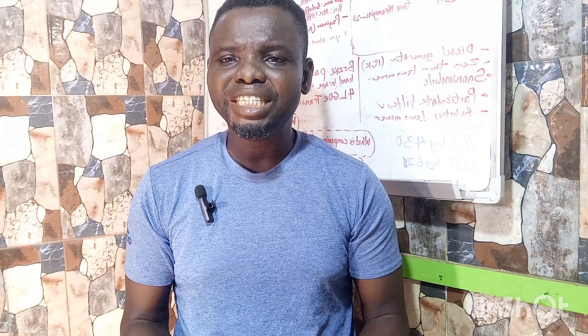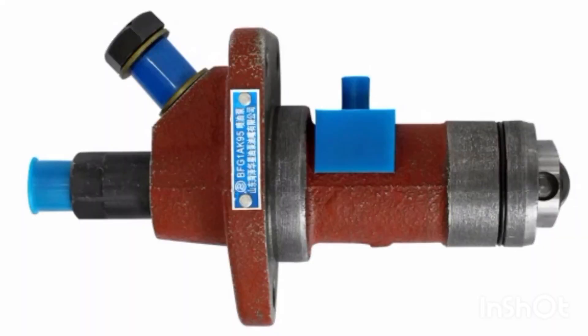Number six: if you have a single-cylinder injection pump — such as on an Lister or similar engine — look at the shims under the injection pump. Reduce the shims or gaskets. When you remove the gasket, the camshaft gets a better push on the injection pump, which forces the generator to start. Once the engine has been running for a while, you can put the shims back and the engine will keep running smoothly.